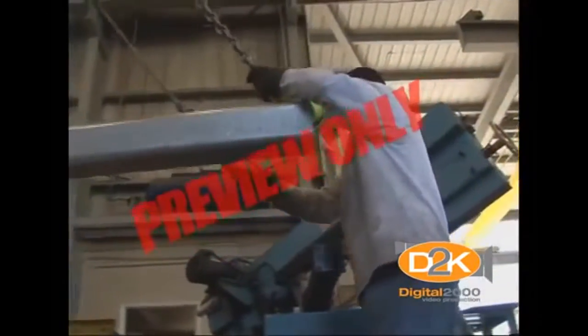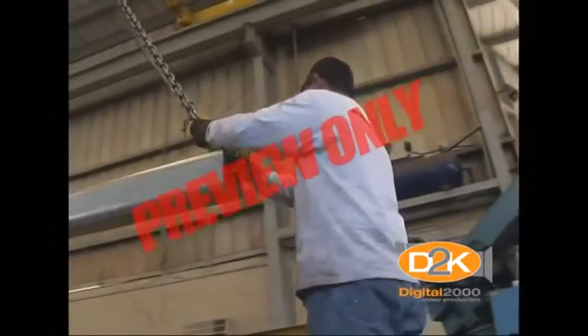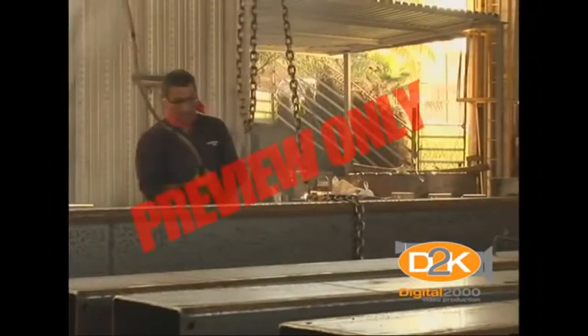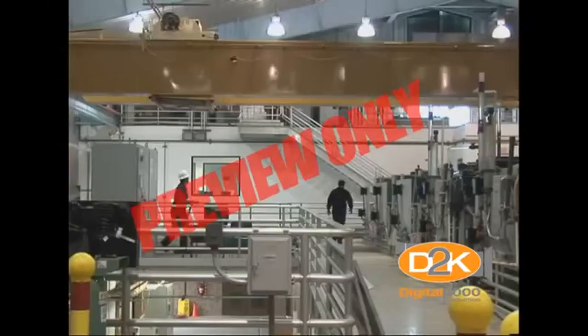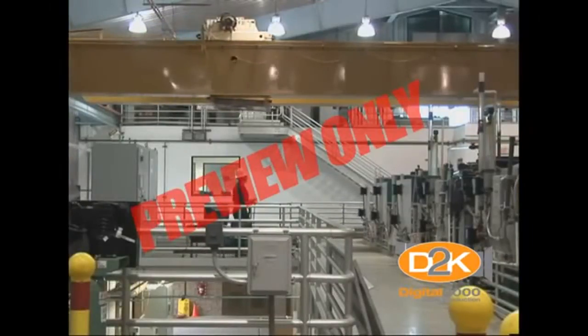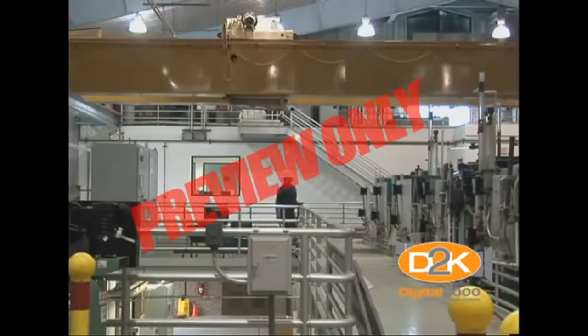Use the following techniques to help avoid swinging loads during the lift. Locate the hoist directly above the lifting point of the load before lifting. Test operate the hoist several feet in each direction that it travels. Listen for any unusual noises and look for any jerky movements.